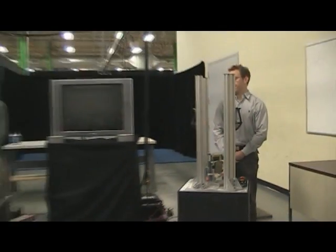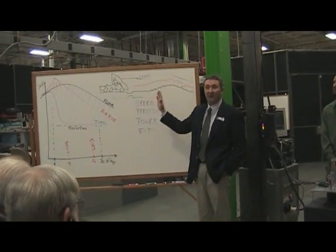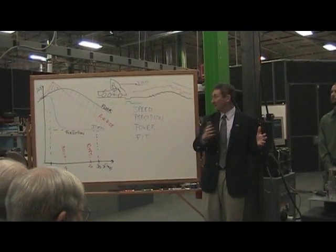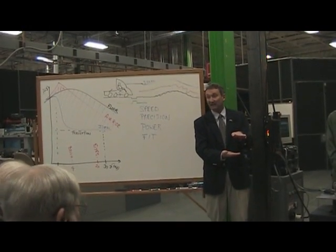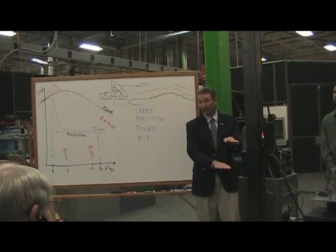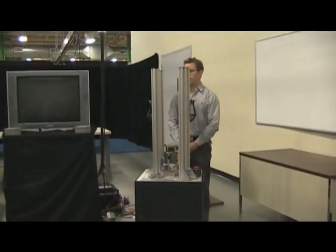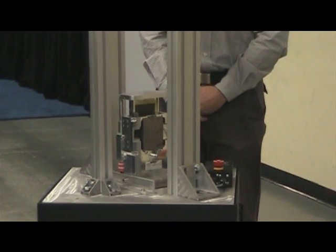Real roads are very complex. In fact, we have a whole range of frequencies that we need to handle. Remember when we talked about whole-body vibration reaching drivers — there was a whole spectrum. This actuator needs to be able to move fast enough to cancel or counteract all of those floor vibrations, no matter how fast they are coming. To give you a feel for that, I'm going to step us through what those frequencies are, just a few spots along the way.